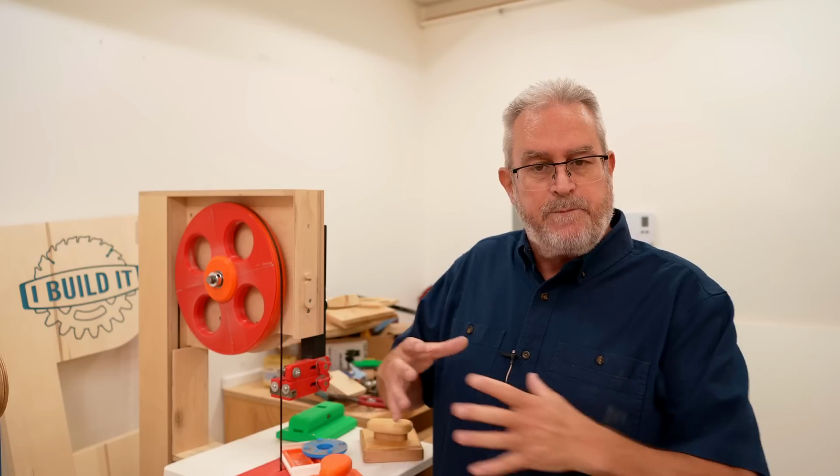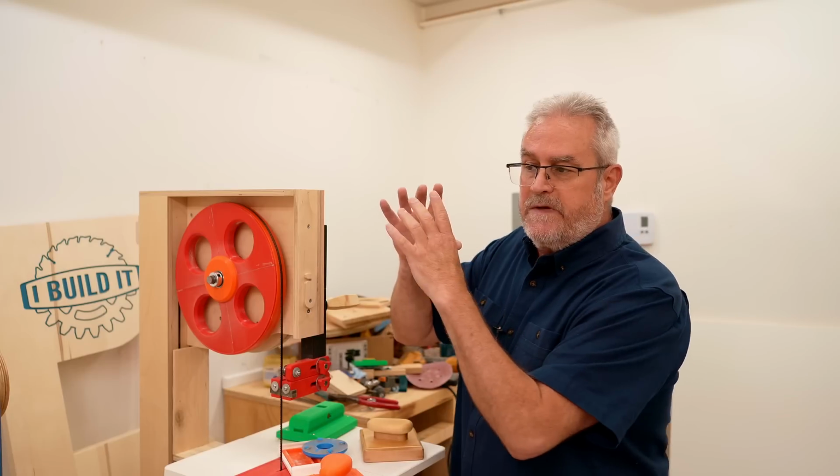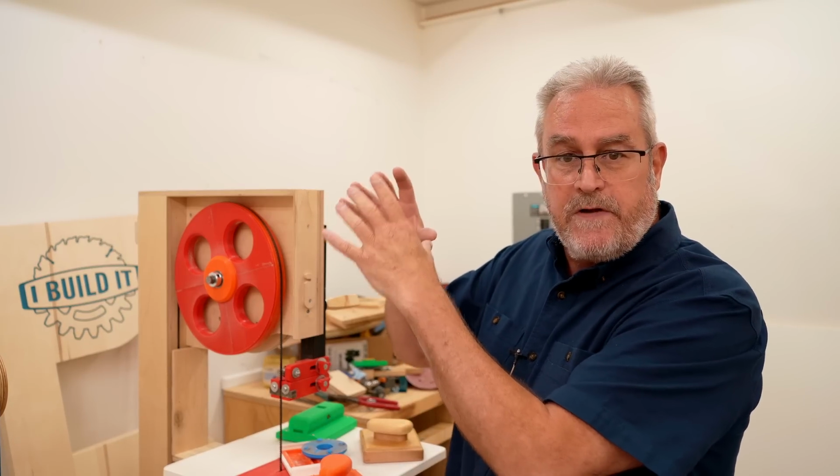However, the 3D printed part is not strong enough to support the load because the plastic is going in layers and not monolithic like an extrusion. It has to be a lot stronger. It has to be bigger. That's how you get more strength. So they take an item in the real world and they say, well, I can 3D print that.